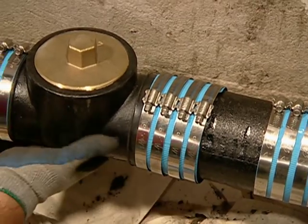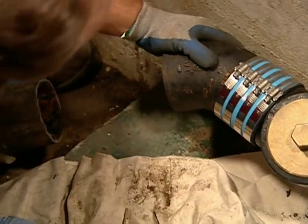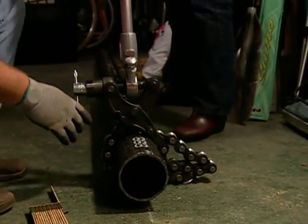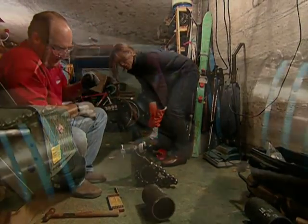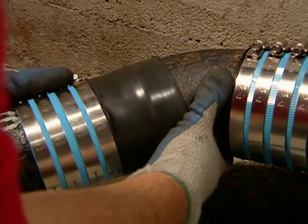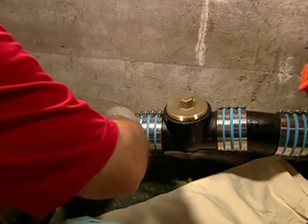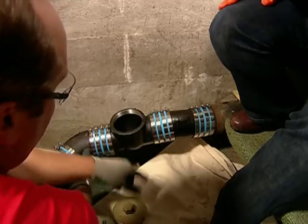All I have left to do is measure this last piece of pipe. That looks about right with pitch — about eight inches. Last gasket there. Now I put the bands over the top, and if I snug them all up, you can call the drain company. Then we can get the cutters in here with this big straight pipe. And look at the size of the clean-out — they can put the biggest cutter they've got right down there.